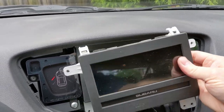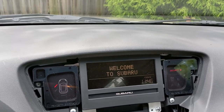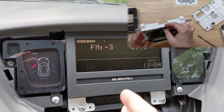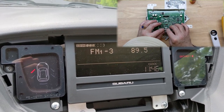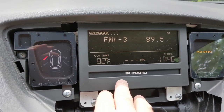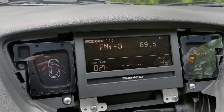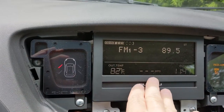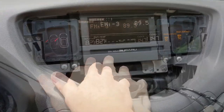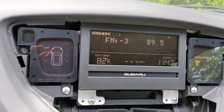After about a week of testing before I posted this video, my display did start giving trouble again, and I found it to be in the LCD part. I did not have any luck finding the LCD module — it would have been very easy to just replace the LCD part and hook up the two ribbon cables, but I just couldn't find it available. Off eBay, for around $45 shipping and all, I did get a spare multifunction display — the whole module. It was scratched up a little more, so I simply took it apart like earlier in the video and swapped out the bezel and the clear lens in much better shape from ours. So far it's working great — looks nice and bright.